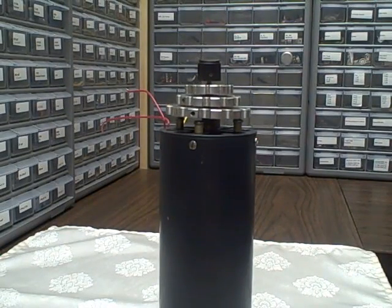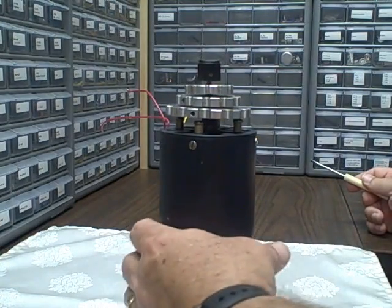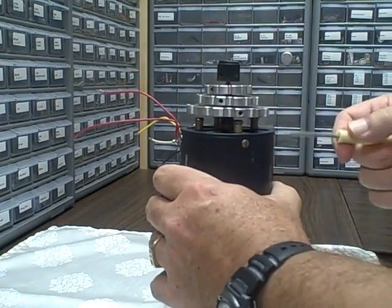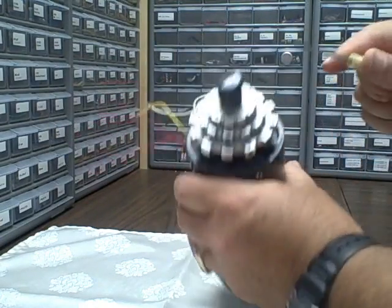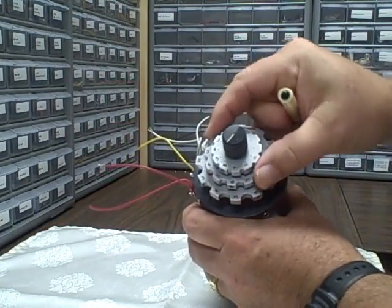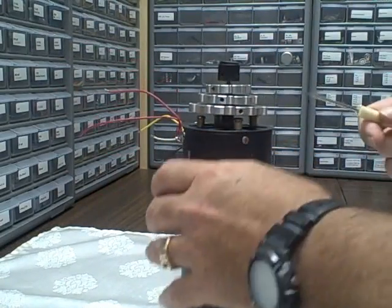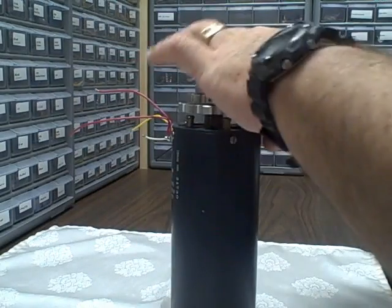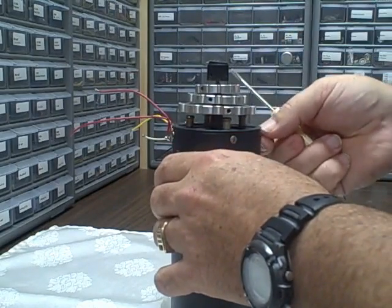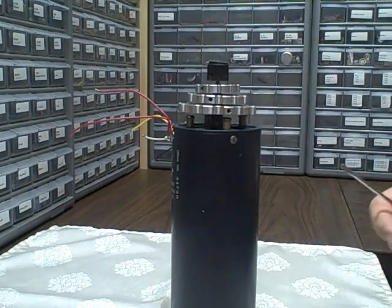Well, what I've got here is a little bit of fun. This is a Decapot — it's a Kelvin voltage divider, and this particular one is a 500 ohm unit. It's got three decades of adjustment available here and then a fine adjustment as a fourth. As a Kelvin voltage divider, each decade represents a constant impedance or resistance in this case.